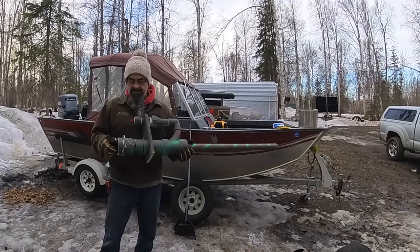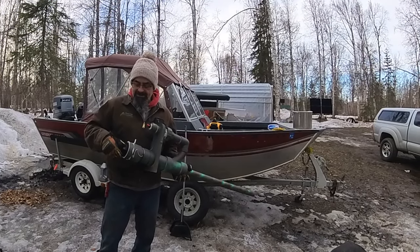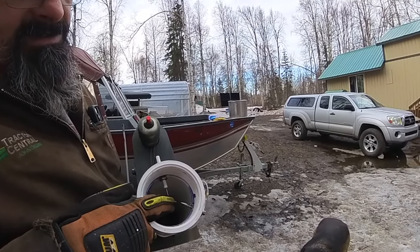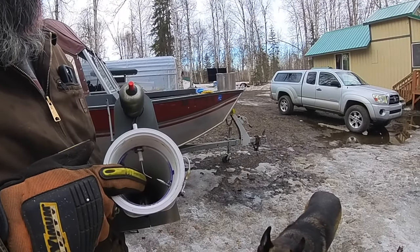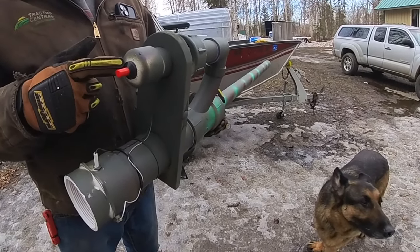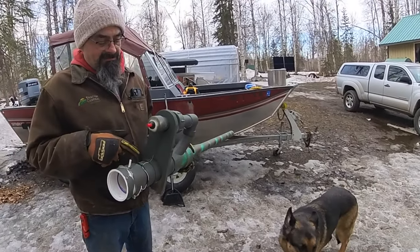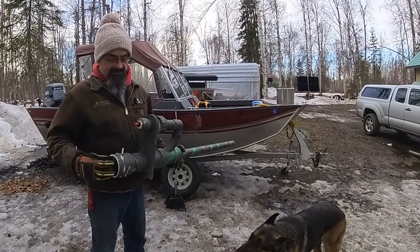And then as I put it together, I had a lot of problems because I couldn't get it to spark. So you can see on the inside here, I added a screw, and there's my igniter. So it's got a point to spark to, but it still wouldn't spark. And I realized this is a one wire. So the igniter is meant to screw into steel, and that makes the ground contact. Well, PVC is non-conductive. So I rigged up a ground wire, the white wire here, going to the screw, and now it works just fine.